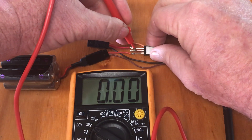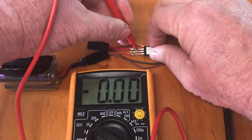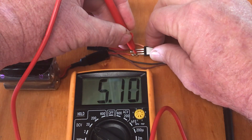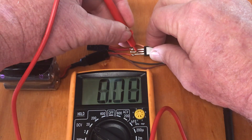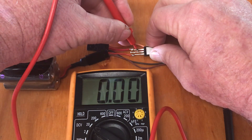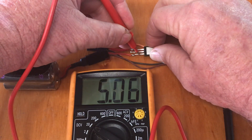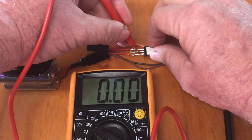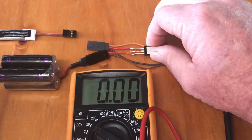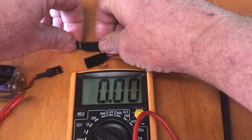If I disconnect the LiPo there's actually no voltage going through the middle — so 5.1V going in, nothing coming out. This is the second diode I've tried and they're both the same. Disconnect this one and reconnect the LiPo.